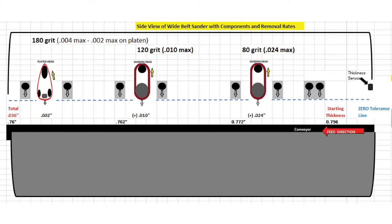Those rollers keep the part held down as it hits each stage of the machine. Whether you have a one-head or three-head machine, the principle is the same — two rollers on either side of each head holding the part down before and after it leaves that section. Each head has a particular grit, and you typically go up in grit to clean the previous scratches. Essentially, a wide belt machine is just a machine with a conveyor sanding flat parts — the conveyor pulls the part in while the wide belt runs in the opposite direction.